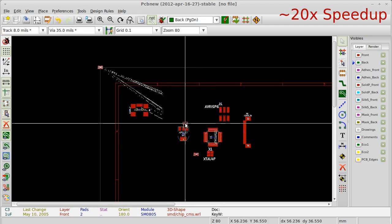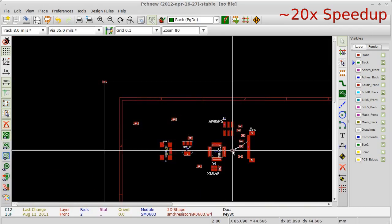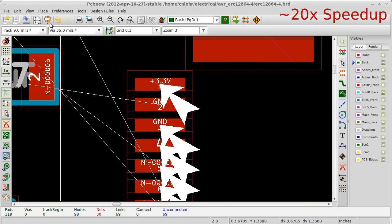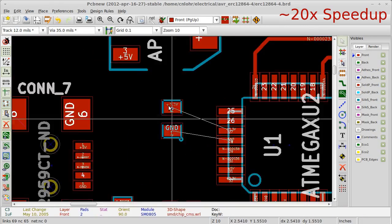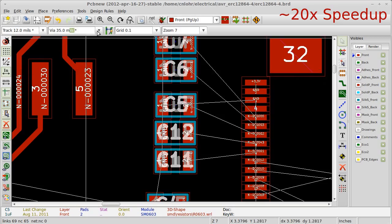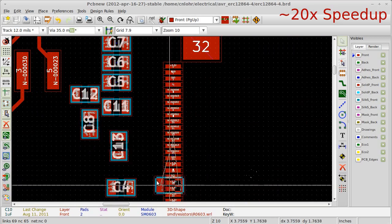Now I'm putting all the parts down in a rough arrangement on the page. Because I'm doing this on one layer, I have to be careful with the orientation and setup of all the parts — I can't have vias, so you've got to be really careful about how things line up. Additionally, because this part uses such fine pitch, I really have to use different tolerances and set things up in different ways than I normally do.